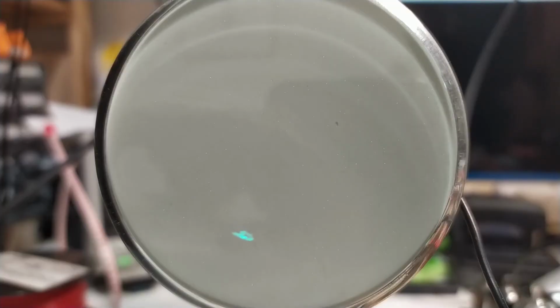I've got the camera centered at the screen now, and you can see the power is just coming up. What I'll do now is start up the signal generator and feed a 15 Hz sine wave of about 2 or 3 volts into the input of the amplifier. So I've got the signal generator on now. And there we go. I'll just center this on the screen here.